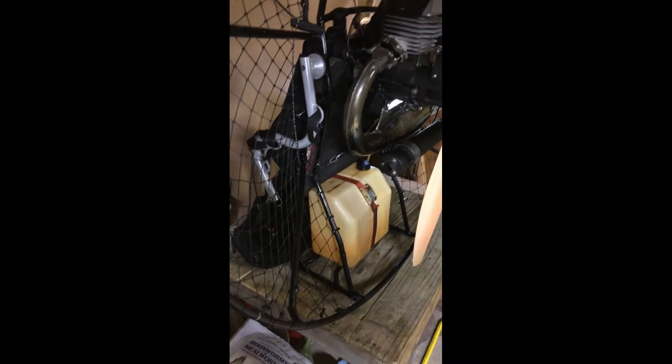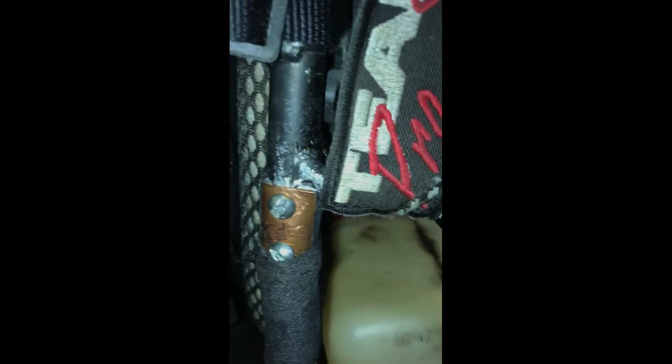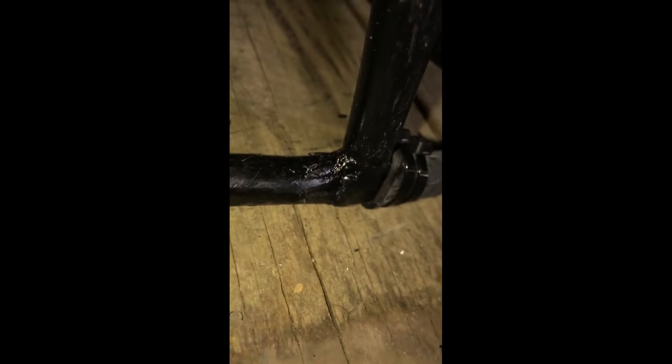The weld on the bottom seems to be holding up fine, and they added a little foot down there. There's still a little bit of wobble to it — I wanted it to fall backwards before, but now it doesn't fall backwards, which is great. Instead of trying to Alumaweld when I fixed this one, this one over here melted, so I put a brace on there. I took some copper tube, cut it in half lengthwise, wrapped it around where this piece goes together, then put two bolts through it — one on each side of the crack. After that I put JB Weld in there instead of Alumaweld, just to fill in the cracks and give it more stability. So far I don't see any more cracks in the spots I fixed.